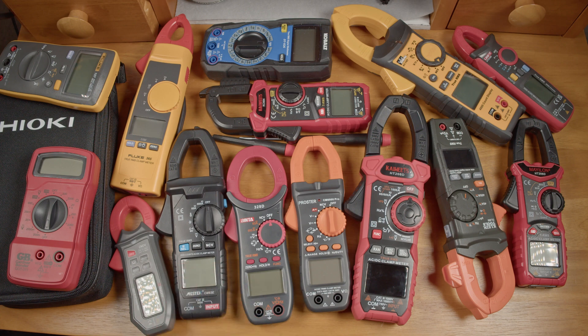"Trust me, bro" applies here. I don't have a transient surge generator that can generate 6,000 to 8,000 volt transients with a 2 ohm source impedance. But after looking inside these meters, I'm still pretty convinced that most of the cheap ones would not pass the proper testing. The basics for input protection are some method of voltage surge suppression, some way to limit current, and enough separation and isolation of the input circuits to ensure that nothing arcs out internally. Those things are relatively easy to look for.